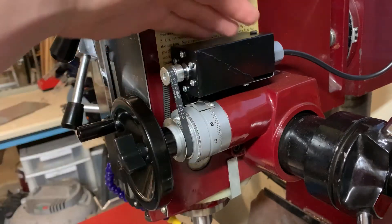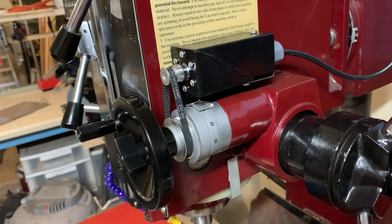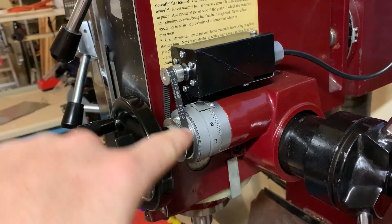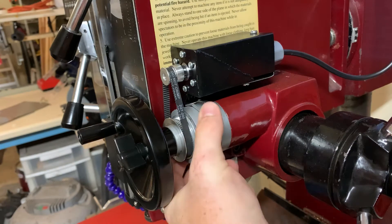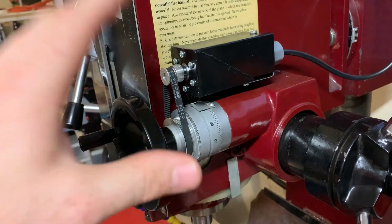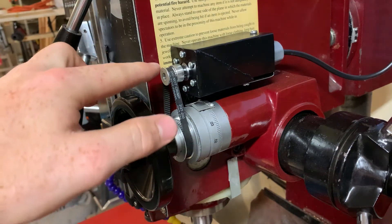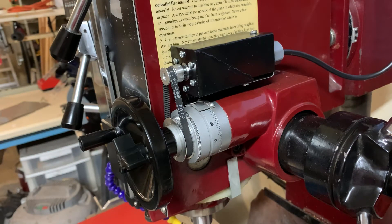Let's zoom in and get a closer look here. The main body of the system is this little gearhead motor. It seemed to have the right specs. I bought it off of Amazon — I'll include the purchase link in this video. It's a very inexpensive motor, about 15 bucks, so it's a great starting point. The other components I purchased were the timing pulleys: one on the snout of the motor, and one on the graduated ring on the mill's quill assembly. This belt also comes as part of that kit. No modification has to be done to the timing gear on the nose of the motor. There's a small sleeve in there just to get the diameter to match the motor — I used some plastic sheeting, and that seemed to be fine. I think the plastic also gives a little bit of cushion to the system, which doesn't hurt.